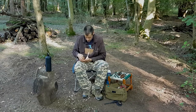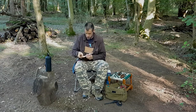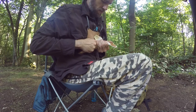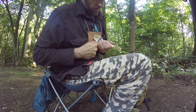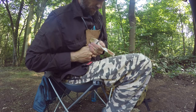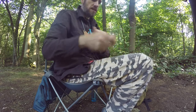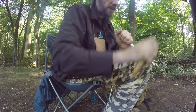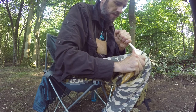Then I'll come back at it from the other side and try and mimic that, using this side as a guide — the side that I've already cut — using the knife like a level to establish a plane. Just check it across ways and from the end, and now this shoulder needs to come in. I'm working across the bowl, trying to come in until these little shavings here just release. I've gone a little bit deep, so I'll leave some trimming from that direction. You can see those little curls, and then come back this way until we just release those without cutting back uphill again. As I'm coming in, I'm just kind of rolling the knife a little bit. Just caught them.